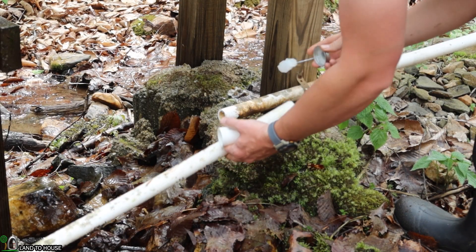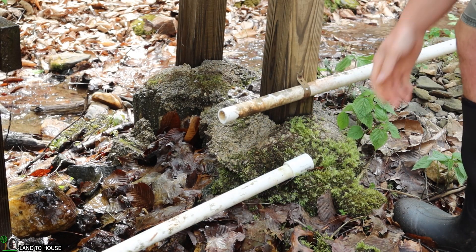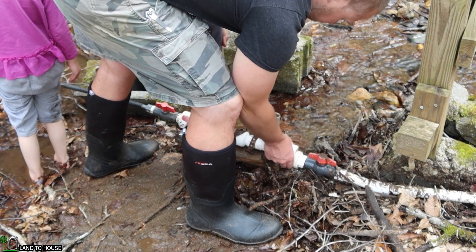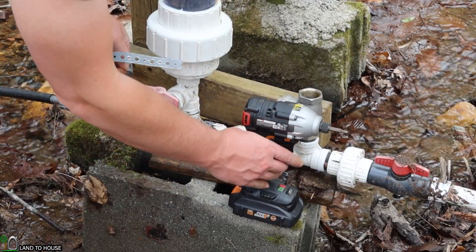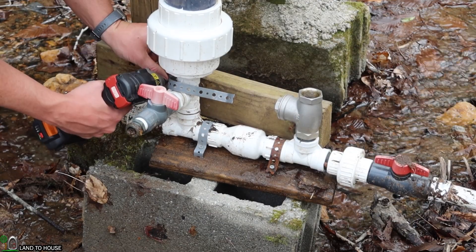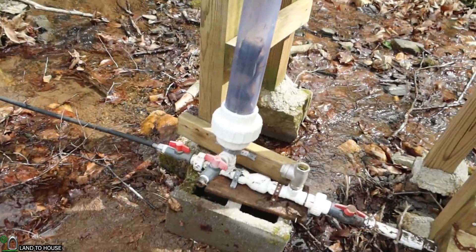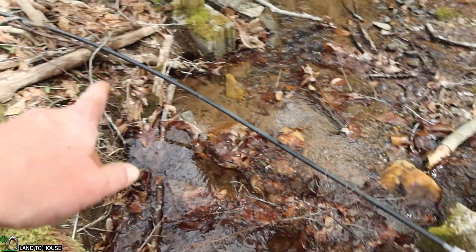I've cleaned my pipes off a bit here so I can add this coupling and hopefully get this back together. Now I'm going to hook up the ram pump to the drive pipe, just using a union. I'm using some metal plumber's strap to tie down the pump to this board back here because the ram pump needs to be locked down or else it will kind of hammer itself loose. This brings the pump up and out of the creek because it was right here for the past five years or so. Now we'll have it up here, hopefully doing a little bit better as far as not catching all this debris. It also brings the delivery pipe up out of the water, which is a good thing.